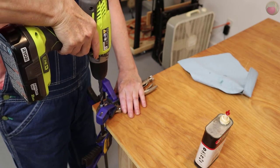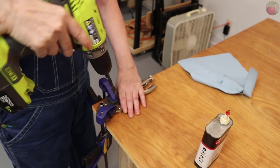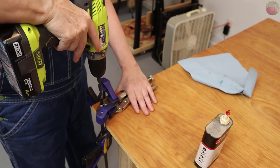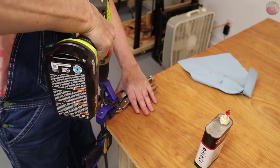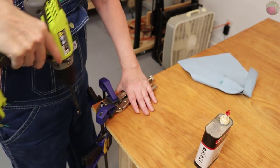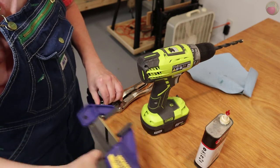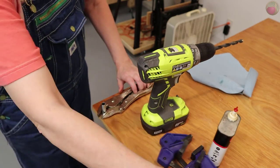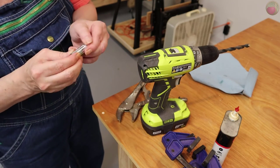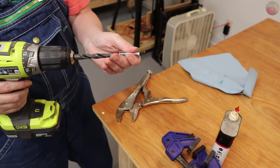Insert the bit and rotate the drill around just a little to spread some of the machine oil on the inside of the spacer. I had to turn my torque up a bit so the drill was still under my control but had enough power to start shaving off the seam. Hold the drill as straight as you can, apply just a little bit of pressure, and let the bit do the work — don't press hard into it. You'll feel when it shaves off the seam. And yes, I forgot to put the piece of plywood underneath and left myself a nice memory in the bench top.